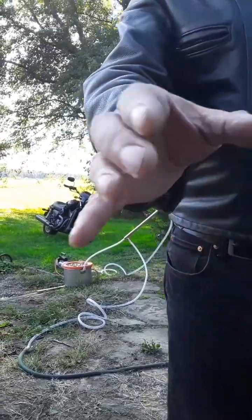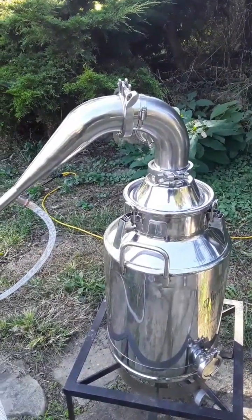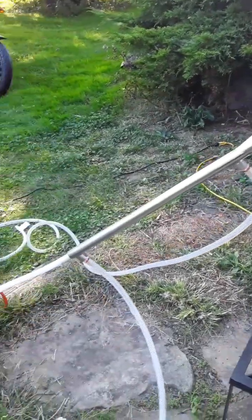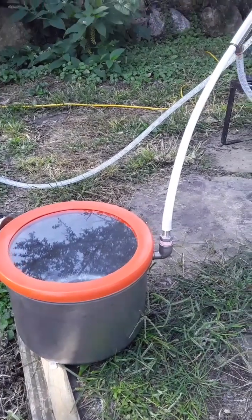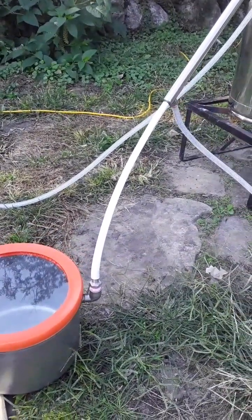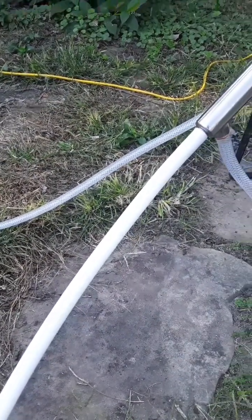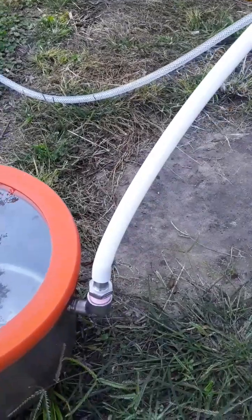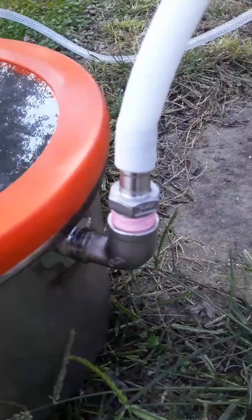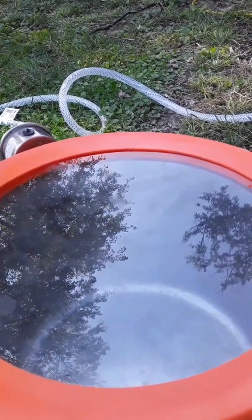To create this still, we took a regular three-inch diameter pot still and the first thing we needed to do was connect it to a vacuum chamber. This is a vacuum chamber pretty easily found on Amazon. We connected it using a Teflon tube — a PTFE hose — which is perfectly impervious to ethanol. We created a fitting that we soldered onto a hole drilled into the vacuum chamber and used Teflon tape to seal it. That's the receiver chamber — where the alcohol ends up after going through the still.